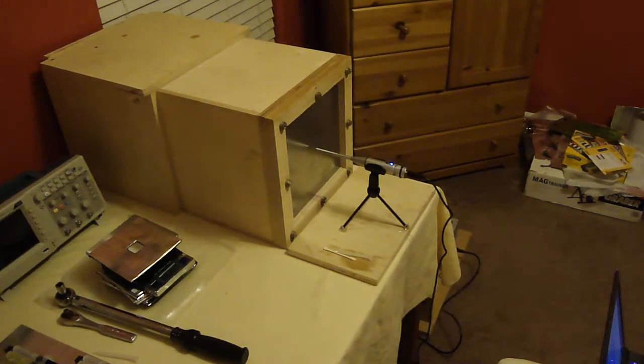And in Room EQ Wizard, I'm using the measure function. I'm using 8 samples, so it's averaging 8 samples together. Start frequency is 20 hertz, end frequency is 1000 hertz, level is negative 30 decibels. Anything higher, and I think it's really pushing the speakers past where they go. I could probably do negative 27 decibels, but anything above that and the microphone is showing clipping. So everything's set up. I'm going to go ahead and run a sweep.